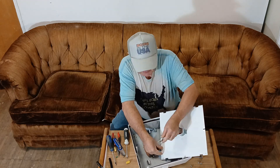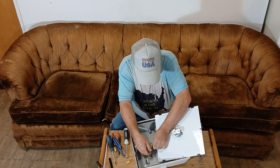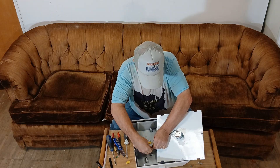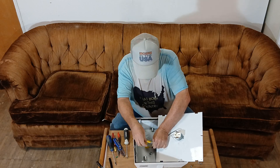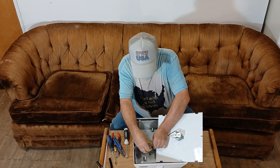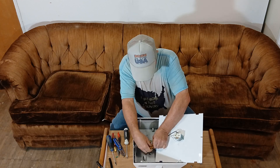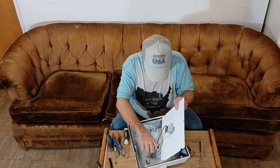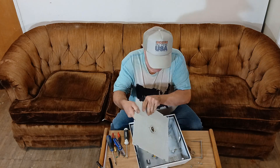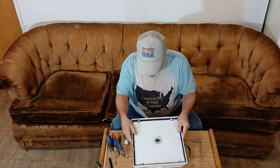We'll do the same with our black wire — put our strands around that solid wire a little bit, get them even at the end and insulation even at the bottom, and get our wire nut on. Make sure our insulation is up inside that wire nut. We'll push these wires down and set our light in here like this.